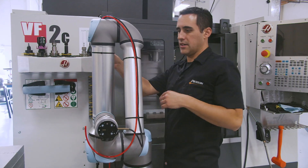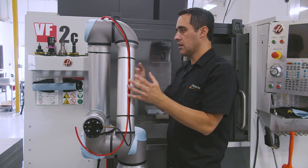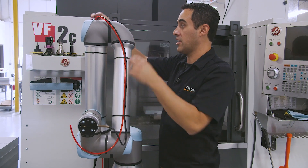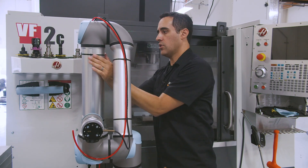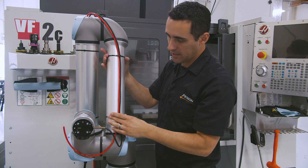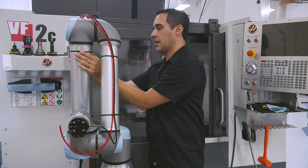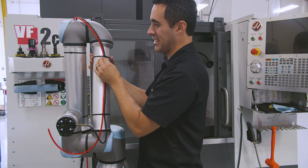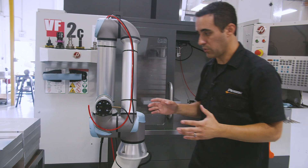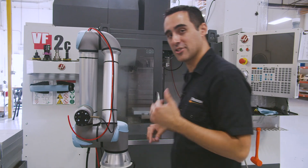All right, these are all done. You don't want to really over-tighten these zip ties — you just want to manage the cables, not lock them in place. When these start moving, they will either have a lot of slack or get pretty tight, and it kind of self-corrects. So you want to leave plenty of slack, especially at the joints. One of the top zip ties needs to be loose so you can pull through. I've got both of them just loosely done because we're in setup mode — that's exactly what we want, routed safely out of the way.